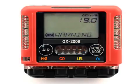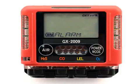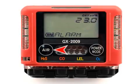If the Air button is pressed, the screen will show the current warning setpoint for the oxygen sensor with the setpoint value flashing. To increase or decrease the numerical value of a parameter, use the Air button to increase or decrease that value. To accept the value, press the Power Mode button. The screen will now show the current alarm setpoint for the oxygen sensor with the setpoint value flashing. To increase or decrease the numerical value, use the Air button. To accept the value, press the Power Mode button. The screen will return to the OXY sensor selection. To advance to the next sensor, press the Air button.